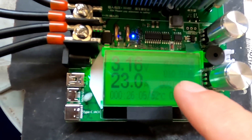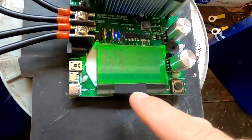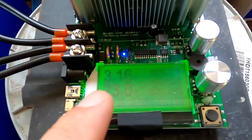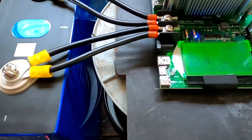We've now pulled 10 ampere hours out of the battery after 26 minutes. I was literally standing here watching the numbers climb — it's so fascinating. If we continue at this rate, it will take 11 and a half hours to fully discharge this battery with this load. That's fine — probably not getting anything else done today.